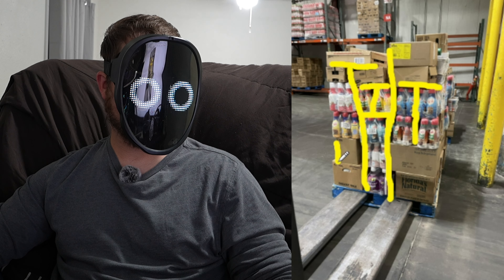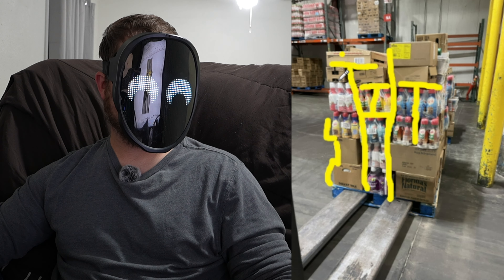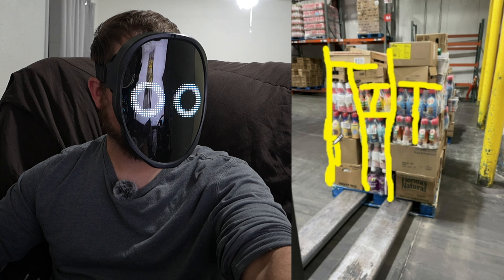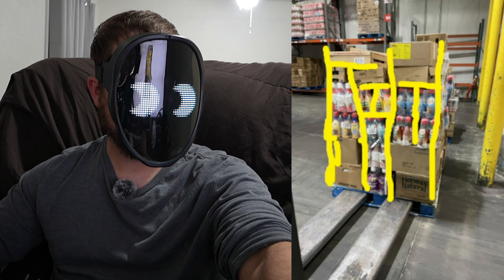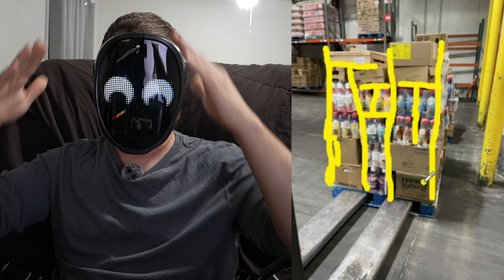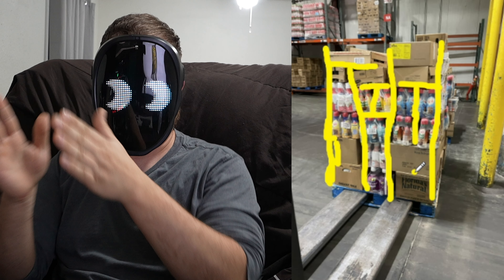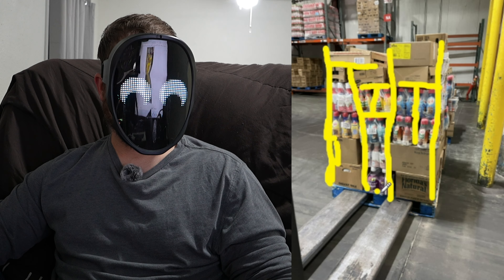He's not keeping to his edges. You can see right here — he juts out like that, which makes everything above it unstable. This is your line right here, and you see that gap. You want this to be vertical. It's not as important higher up, but down here at the base, really keep that straight. Because if you don't keep it straight at the bottom, it's going to taper out or taper in, since you're matching each layer with the one below it. You're feeling for that edge and setting the box down.